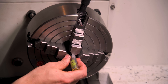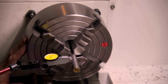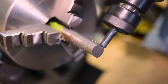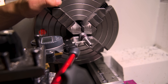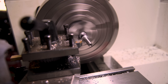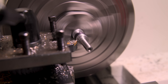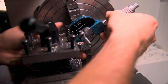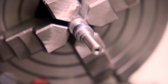I do have plans for some accessories, but to start off with I thought I'd give the four-jaw chuck a go by having a practice run at this crankshaft for my next project. I machined some flats on the end of my stock to make sure there was a nice surface for the jaws to slide on when it came time to offset the crankshaft. There's something a bit magical about eccentric lobes, wouldn't you say?